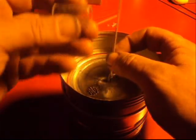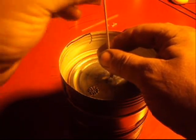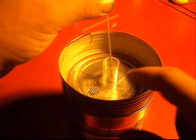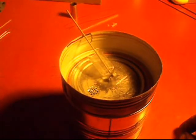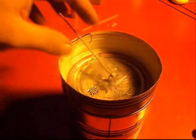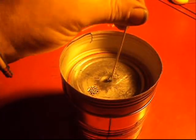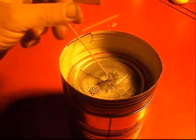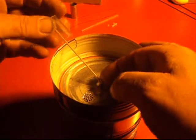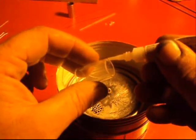Now we're going to have to keep water in here — I want water to come in here and cool this off, and be able to drop a few pieces of ice. This is one of those little plastic test tubes; I cut a piece of it off and this edge is the original edge. I took sandpaper — regular plumbing sandpaper — and roughed up the spot down here where it's going to go, then cleaned it up with alcohol. I want this to point towards my piston here; I played around with it and found that's the best way for it to flow inside there.